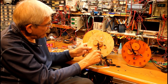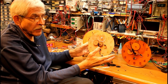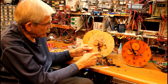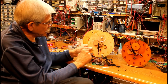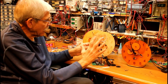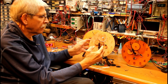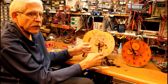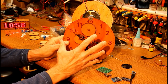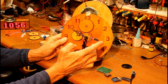There is some backlash, really because of the stepper motor — the gears in there are not real high quality. When you're looking at something that costs a couple of dollars, you're not going to get that. So this clock is going to be off a little bit; the hands are only good within about a minute or so. Once we have all that put together, we can put the magnetic sensors back in, and that pretty much takes care of the clock end of the construction. Now we've had a good look at the front of the clock — the hands, the gears, the magnets on the inner gears, and the hall effect sensors.